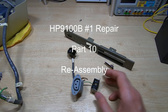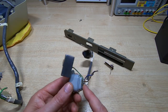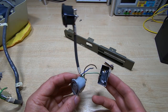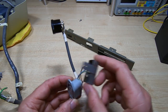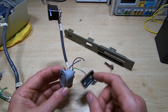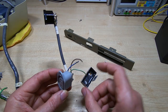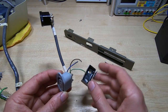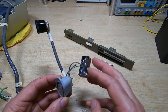Before refitting this, I decided to check the filter. I was a bit dubious with these — they're wired permanently across the main socket, which means whenever these are plugged in, they have mains across the filter. These do vary quite a lot; sometimes it's just a coil, but this one had a couple of caps and they're potted, which is a real pain to get out. With the multimeter the caps read okay, but when I put it onto the high voltage leakage tester, it was extremely leaky, so I decided to replace the two caps.